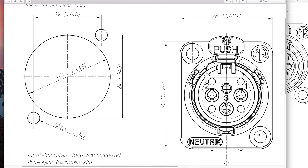Why does it matter if the diagrams don't tell you how big the hole is in the actual connector? It's not a huge deal, but it matters if you want to stretch your hardware limits. They recommend 3mm. You could easily get away with 4-40, maybe step up to 5-40, because there's enough room for that. But if you wanted to get up to 6-32 hardware, that's going to be a little too small for that hole, and you don't even know if it'll fit through the connector. This is something where you may have to dig deeper, look through diagrams, or physically try to put the bolt through and see if it fits.